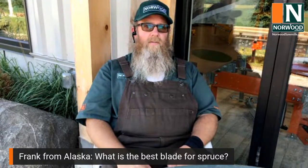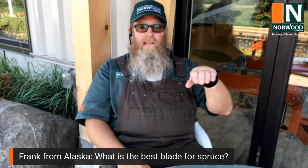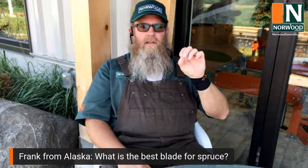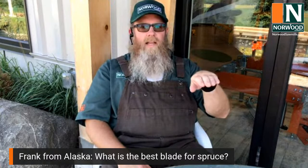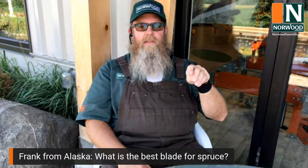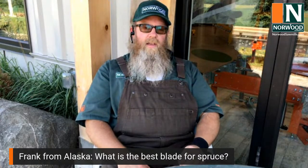It's going to start giving you bad results. You'll start seeing what I call blowout or fraying on the ejection side of the cut. As soon as that blade loses that really good tip on the tooth, you'll start seeing this out of the edge of your boards. And that's a sure indicator that, okay, this one's getting tired. I'm going to have to start watching if I'm going to be getting waves or dips and stuff like that. So keep an eye out for that.